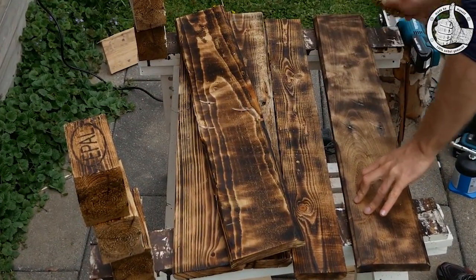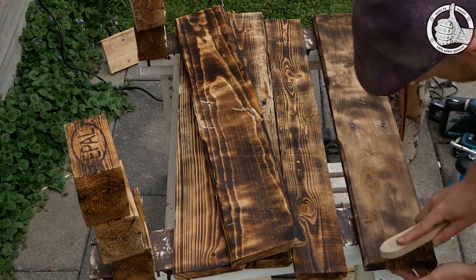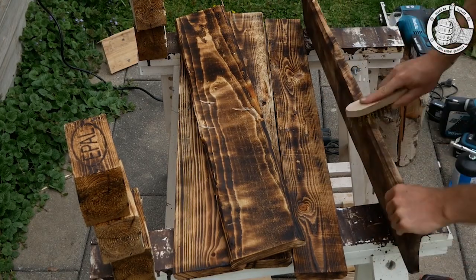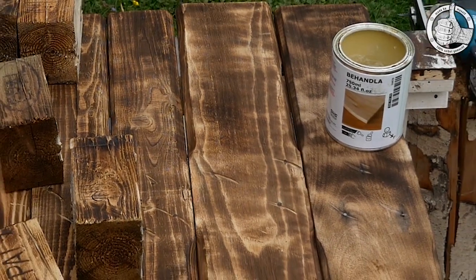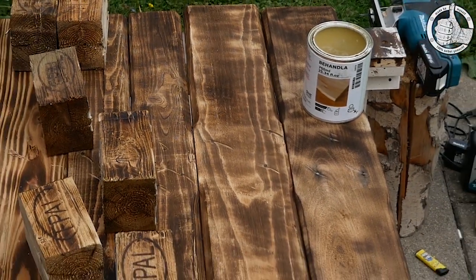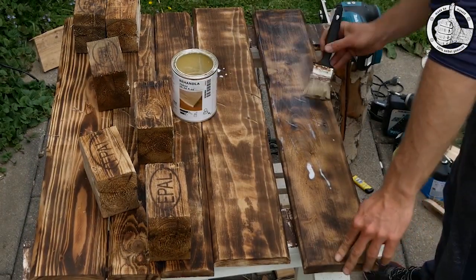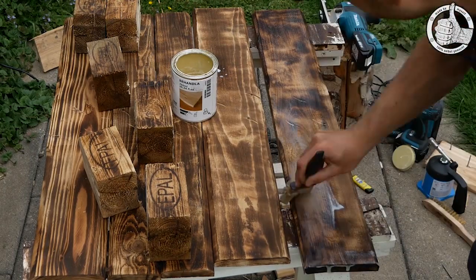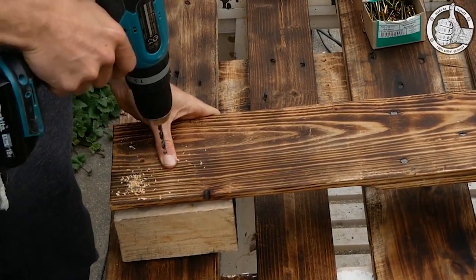After burning, you just go over the wood with a steel brush until the ashes are completely brushed off and you don't get your hands dirty touching the wood. By brushing, you can also lower the degree of blackness again. You might as well leave the wood as it is, but I went over it again with some wood oil because I think it's got a beautiful shininess in the end and feels better. But again, it's not necessary because the structure is already very good after burning.